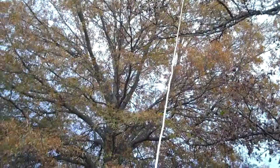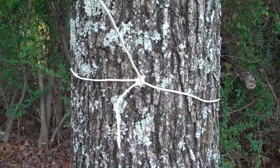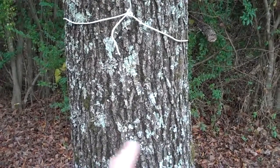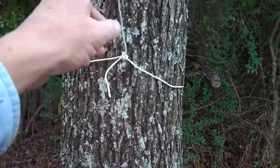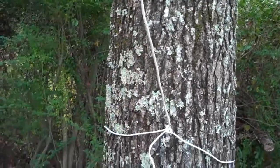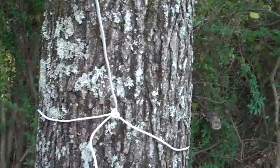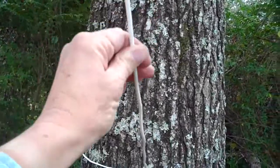This one is so easy to pull — that antenna just goes up nice and easy now. Piece of cake to pull. I've temporarily tied off the new rope that goes through the pulley. When I go to Walmart today I'll pick up some ratchet straps — a six-foot ratchet strap — put it around that tree, and hook the bungee cord from the ratchet strap to this rope. The idea is it'll have slack where it can bounce up and down. When we have storms, the trees sway, and if your antenna is tight with no give, it'll break. The bungee cord will stretch out and sway with the tree, keeping the antenna from breaking.